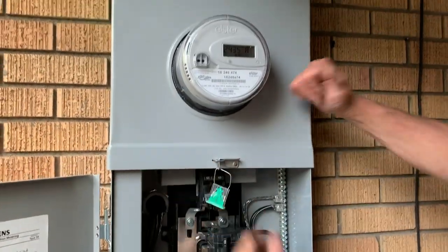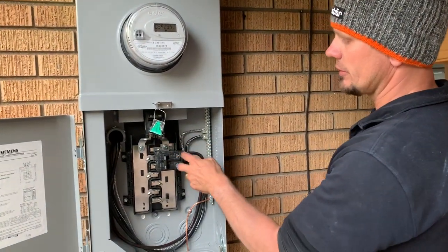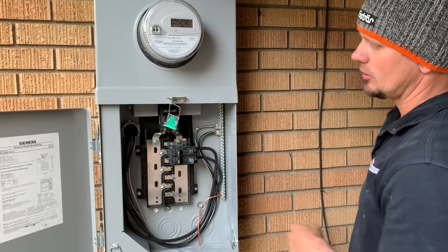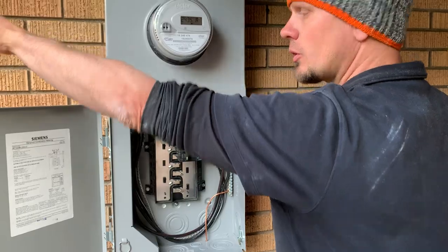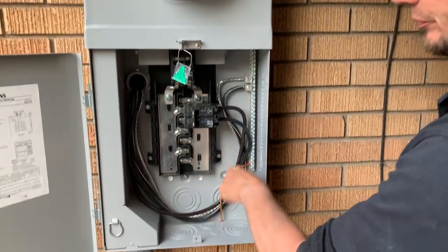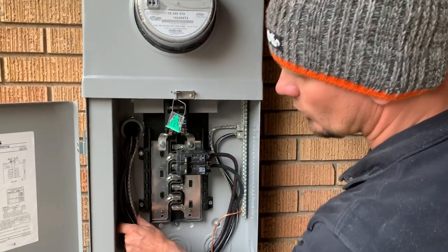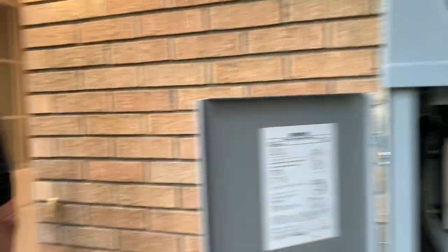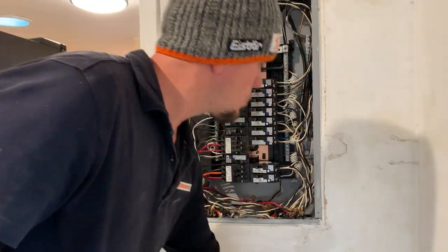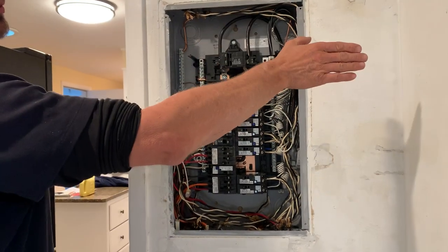So no longer can we just have a meter cabinet with a bypass lever. We have to have the bypass lever, fifth jaw requirement in a combo unit with the main breaker. And then if you have a main panel inside, you're supposed to have the MBR one or two clip here to tie down. This one I don't have to, because this is the main — this is a sub panel now. But the minute I feed a sub panel into the house, whether it's 200 feet across to a garage, in an attic or crawl space, or back to back like this with two feet of conduit — this wire has to be four wire. Some of your old homes have an SE; this is an SER. So this right here is four wires. This separates our grounds and our neutrals on all sub panels. This is no longer considered our main panel — this is considered our sub panel. And so our grounds and our neutrals are completely separated: one because of arc faults, and two because of faulting out on the ground. They want the fault to go up to the main to the grounding electrodes.